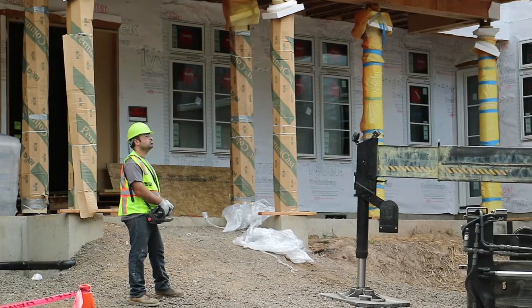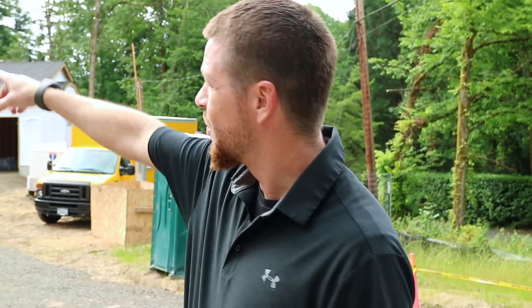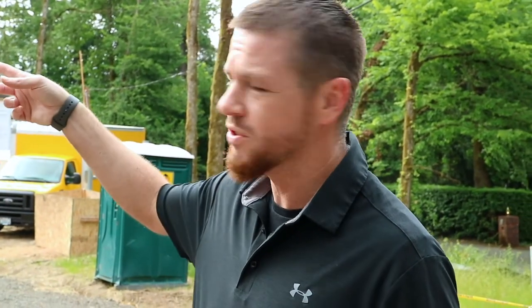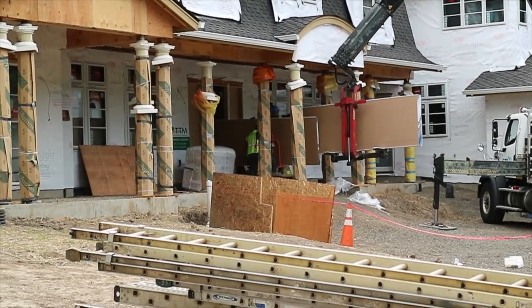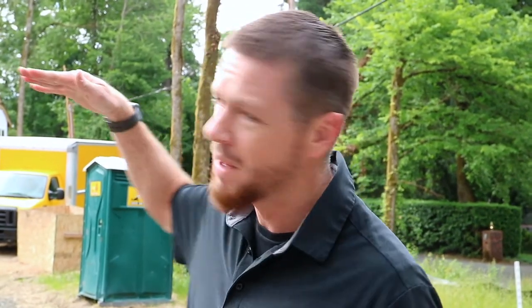It worked with a little joystick. It's kind of cool. It's like driving a remote control car, except they're dropping drywall off. We also pulled a window up top, you'll see up there. When we stock drywall, which is what it's called, the windows aren't big enough to get the drywall in upstairs, and the guys don't want to move it up the stairs. So what we have to do is pop a window off so that the guy with his little gizmo can raise it up and put it straight in the second floor. So that's kind of what we got going on today. So let's go inside, take a look, and I'll show you guys progress.